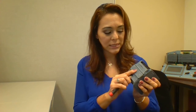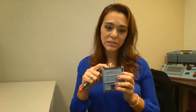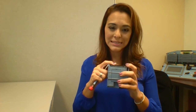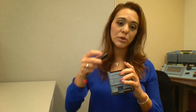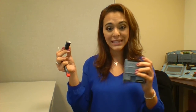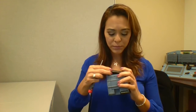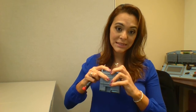These signal ports are very easy to install. All you need is to prop this open, add your signal board, and place it right back onto the front of the CPU. The terminal blocks are also a removable piece, and what's nice about being able to detach the terminal block is that you can do the pre-wiring on the terminal block even if you don't have the PLC in front of you, and when you're ready you simply plug it back in and it saves you a lot of installation time.